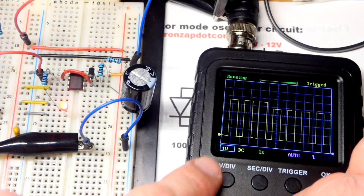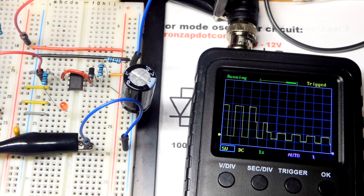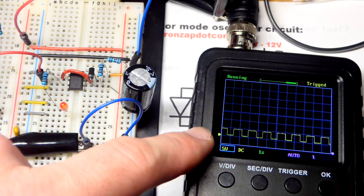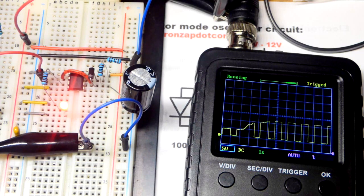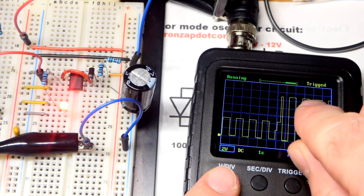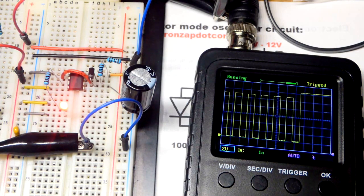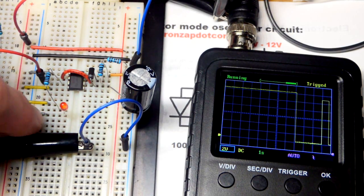Positive goes to the long lead of the LED, short lead to the resistor - it lights up when the output goes low. That's another reason why at five volts the LED isn't terribly bright. Let's change to five volts per division - you can see the same square wave but now about a fifth the height since each square is now five volts. Let's quickly put this up to 12 volts - you can see it going up. We've got five, ten, probably about 11 volts - we're still losing about one volt. At two volts per division you can see two, four, six, eight, ten and about a half - so about 11 volts out of 12.